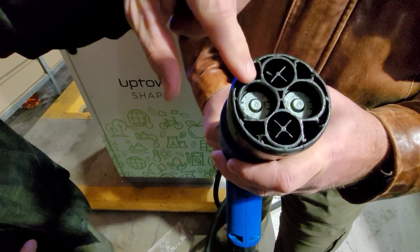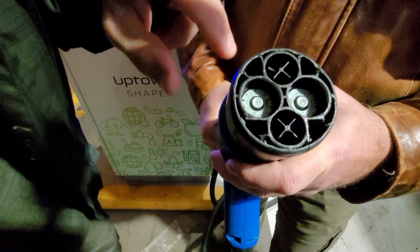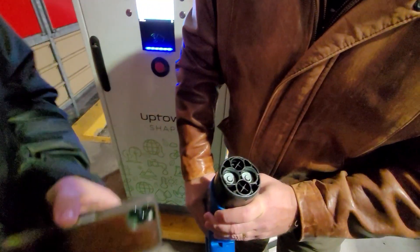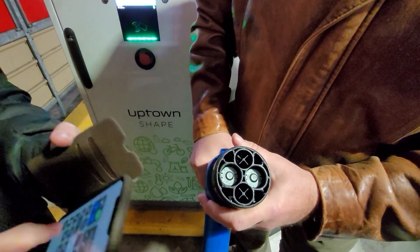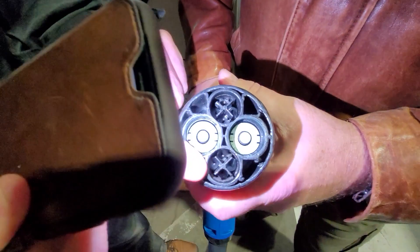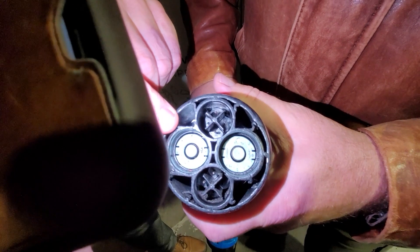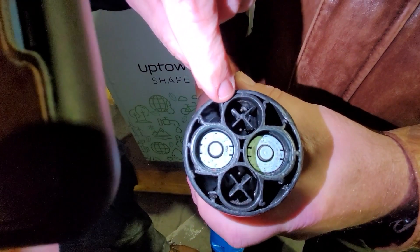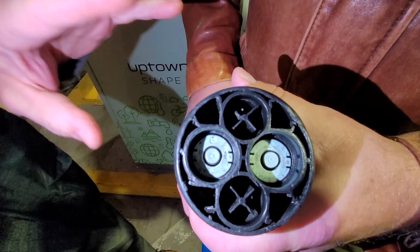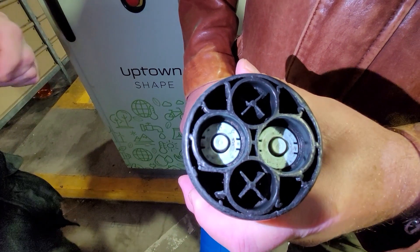I don't see any carbon, I don't see anything burned, I don't see anything melted, so I'd say this is probably pretty safe to use. There are little communication pins in there — if you look inside you can see these little wire pins. None of them are damaged right now, they all appear to be straight. The only damage is this piece of plastic which is folded over. Anyway, this thing's okay to plug in and charge — no trouble to use this on any CHAdeMO vehicle. But it is important to check that before you get started.